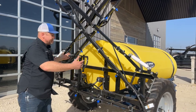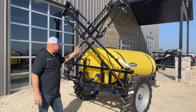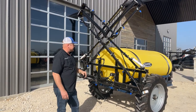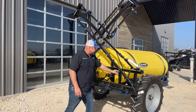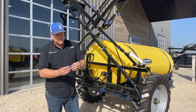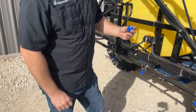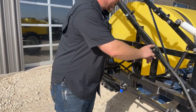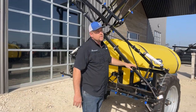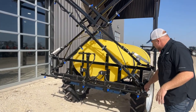Your left and right boom sections are now set up for the boomless nozzles. These are XTO 24 boomless nozzles — you've got about 32 feet of spray coverage running just the boomless nozzles. You've got 35 feet with the boom. You've got the AIXR 1103 nozzles with individual strainers — a very high quality tip. It's an air inducted tip for a little bit larger droplet size, which helps with drift. The nozzle check valves on each nozzle are something you see on the bigger sprayers — it's really nice, and they're not that expensive.